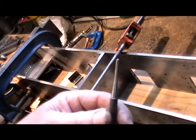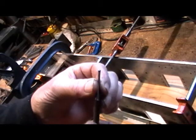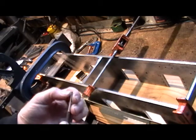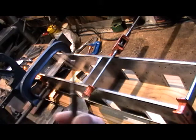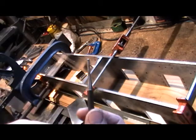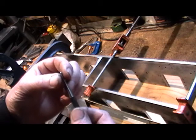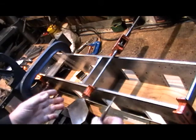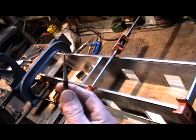I just use an ordinary punch with a very shallow point on it, so that when it's in the hole it locates into the hole before it touches on the part that you're punching. You can make these out of silver steel and go to the trouble of hardening and tempering them in different sizes, but what I do is I've got this one eighth punch and I've got a series of little bushings that I put over it with a one eighth hole in, for various size holes that I punch - I've just got a tin somewhere with various bushings in. So that's what I do.